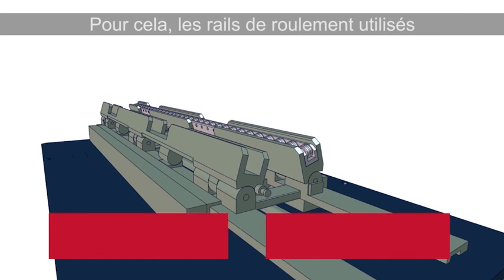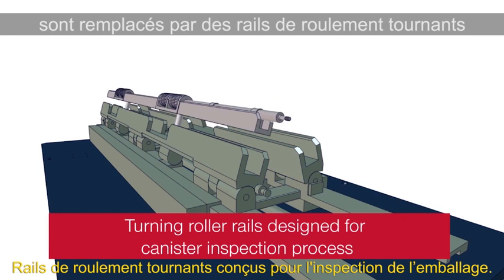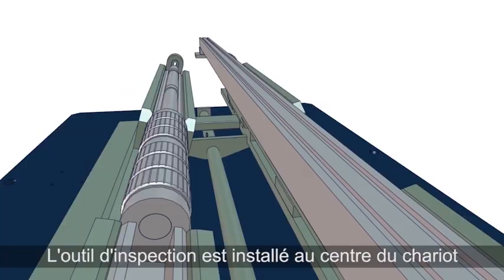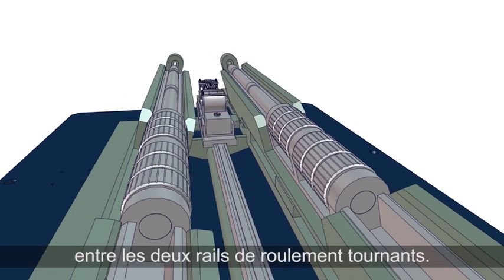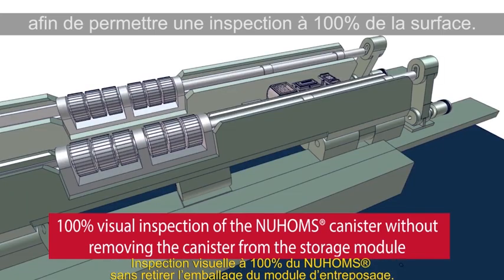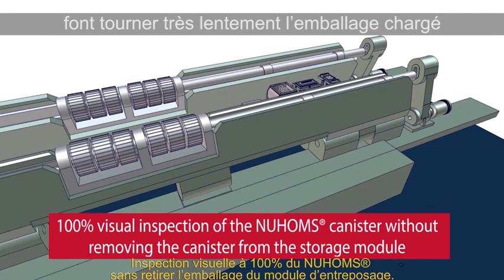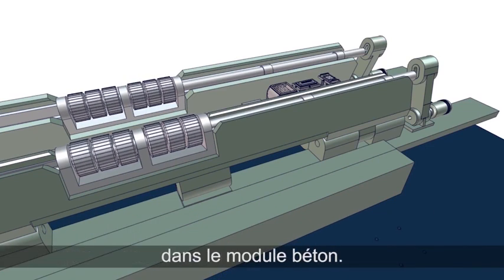In order to do this, the roller rails used for loading operations are replaced with turning roller rails designed for canister inspection. The inspection tool is installed at the center of the RRT between the two turning roller rails. The inspection tool glides back and forth along its own track so that it can thoroughly inspect 100% of the canister surface. The turning roller rails very slowly turn the loaded canister while it remains safely stored inside the HSM.